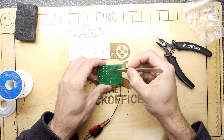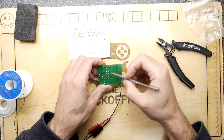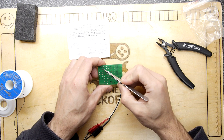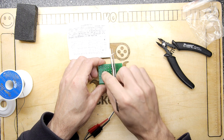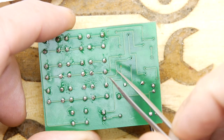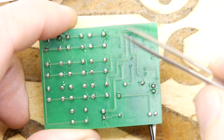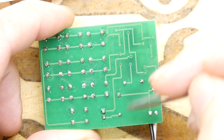So 1479, you can see they're wired differently. So they're basically out of circuit and the other ones are doubled up. So what you could do, you could cut the tracking through here, and then you could basically solder jumper through. So just to show you there, that's the 1479, 147 and 9. And you could see again how they're wired differently. And then 8, of course, is a reset. So yeah, you could just have jumpers that go from here, and then you literally have four wires, and that you have a first digit wire, second digit wire, third digit wire, fourth digit wire, and you can jumper them across.